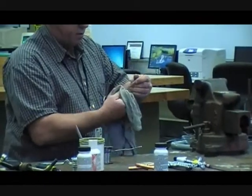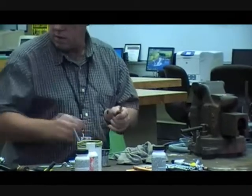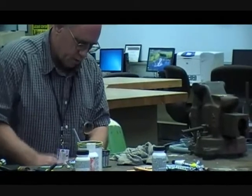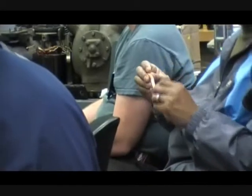I want to pass this around. I want you to look at it — you should see a ring of solder all the way around. I'm going to sand it up just a little bit; that may actually help you be able to see. While that one's going around, I'm going to be preparing my other one. If I had continued to add solder to it, I would fill up the pipe. It doesn't take much — just enough to fill in between the two pipes. Capillary action is what does that.